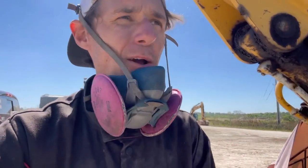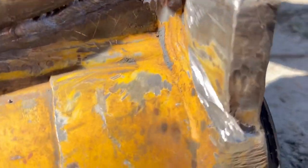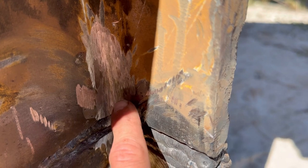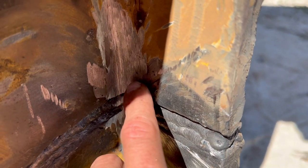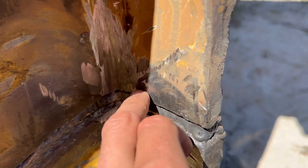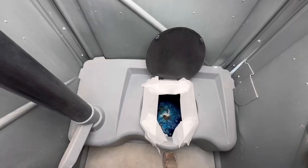I've been welding a little bit more, and because of the expansion created by the heat of my welding, we've uncovered some stuff that I'm really not stoked about. So we knew about this crack down here earlier — I went ahead and opened that up, it's ready to be welded. But as you can see, we have a crack moving. Very, very faintly there's a hairline crack moving this way. So I'd imagine this thing is pretty much shattered in here. The joys of working on a job site.